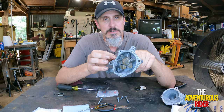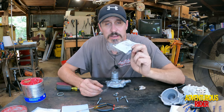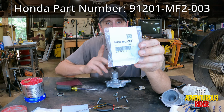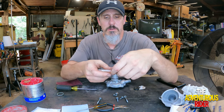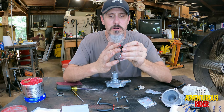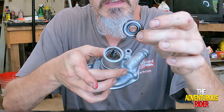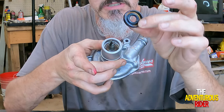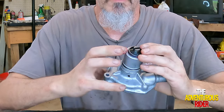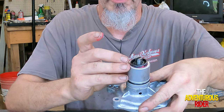Just to be on the safe side, let's go ahead and replace all the O-rings. The first one we're going to do is the oil seal — that's the part number right there, I'll display it on screen. When you go to put it on, add just a little bit of grease to the outside to help it slide on better, then make sure the opening is facing the outside just like so, and press it in until it's flush with the housing.